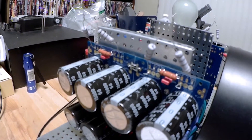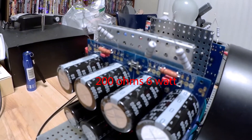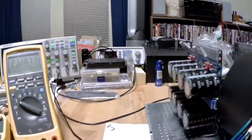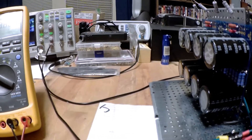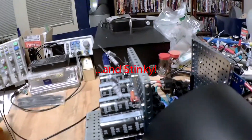So we have 200 ohms at 6 watts, which is just barely enough. Originally I tried 100 ohms — here's all our connections — and I tried 100 ohms at 3 watt and they got rather brown. Smoked a little, so I decided no.